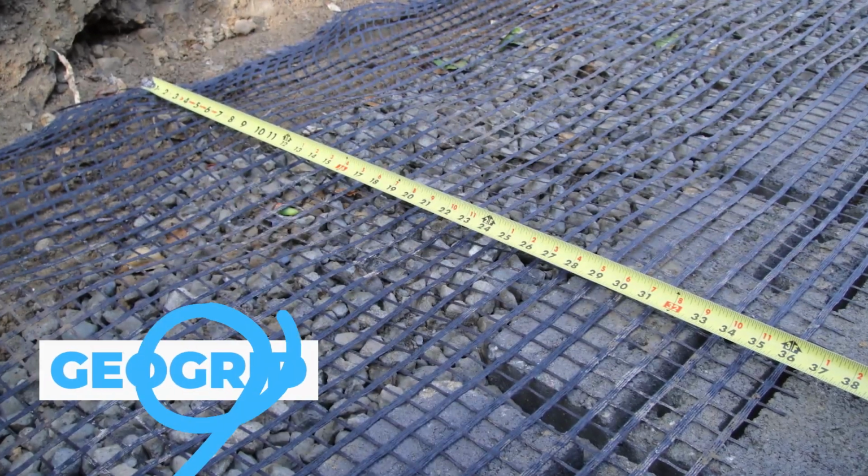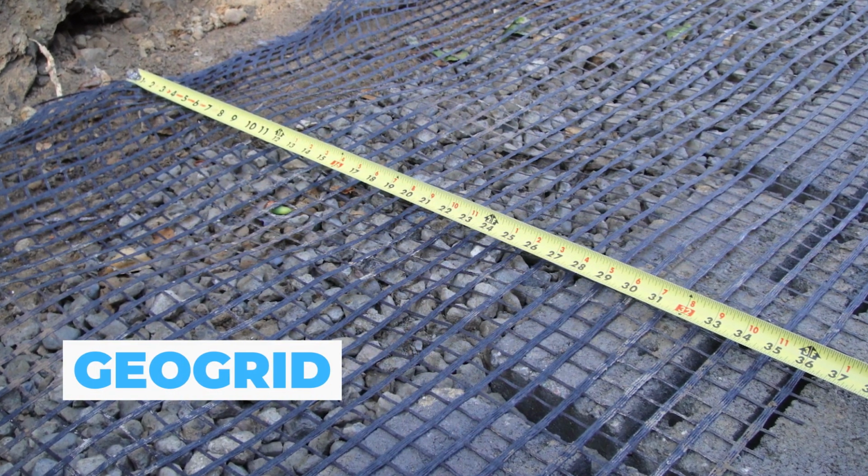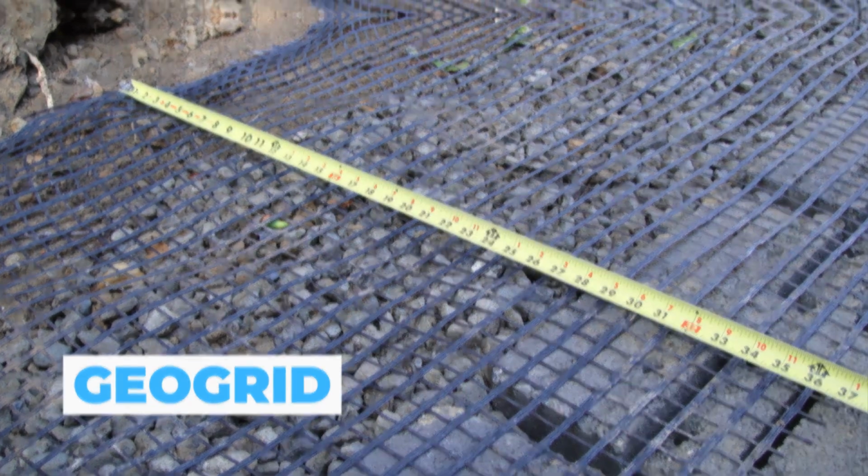If it isn't a garden bed and it's retaining any kind of soil, any kind of load, surcharge at all, it needs Geogrid. And this is installed from the top of the first course and then every other course the rest of the way up. Now, still go back to your block manufacturer's guidelines, but I know this is how Allen Block wants it, and that's how we install it. It's also very important to remember that depending on the height of the wall, the depth the Geogrid needs to go back in the wall can vary.